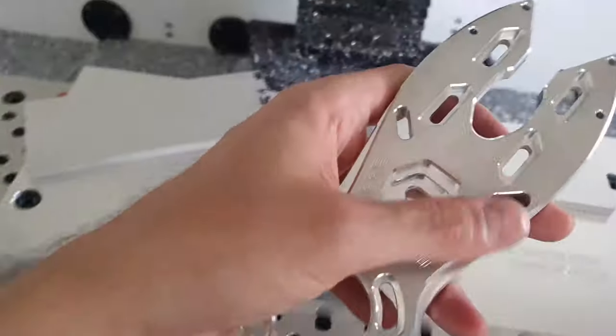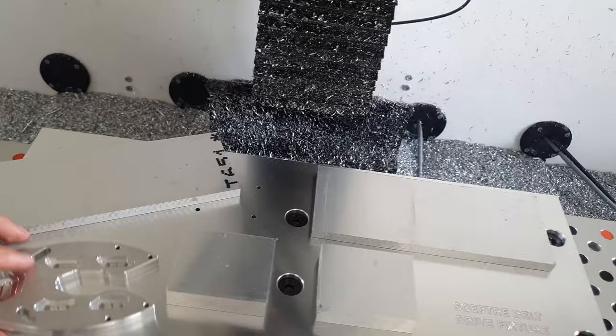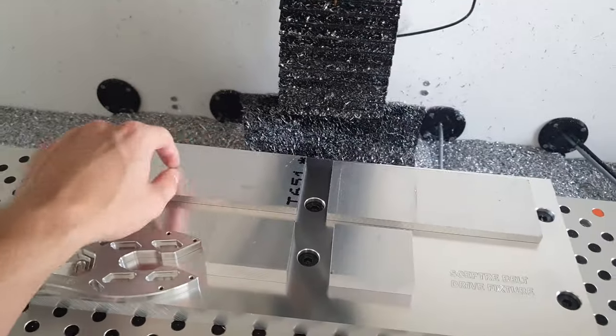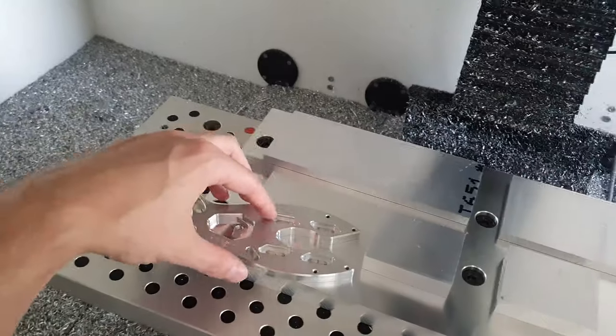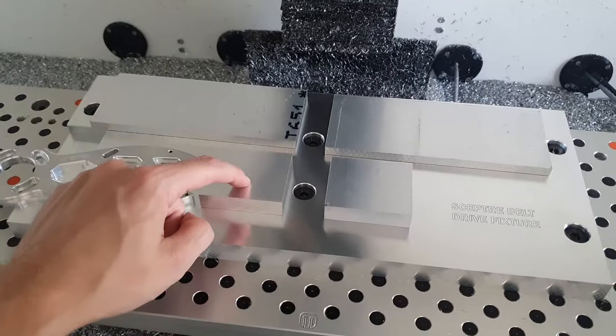I can show you. So these slots have to be machined beforehand, and after that we can use bolts to bolt it down to the fixture plate, and we can machine all the remaining features. Same goes for the clamp. In the next video, I will be preparing the stock, I will be making the slots, and then we can put it on the fixture plate to test it out. And then later on, hopefully, if everything goes well, this can become the production fixture.